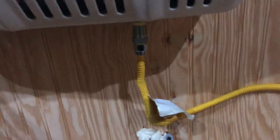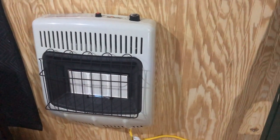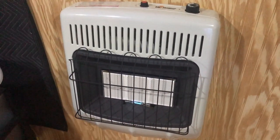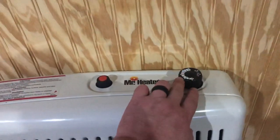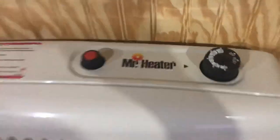There's my little soapy water bottle that I sprayed on all my connections before I even turned it on, and we got no leaks. The room is nice and warm right now. If the room temperature doesn't drop for a while, the unit will shut itself off — it will turn the pilot light off — so you just come back over to the gas valve and turn it to the off position. Let's go outside and take a look at what we've got on the outside system.